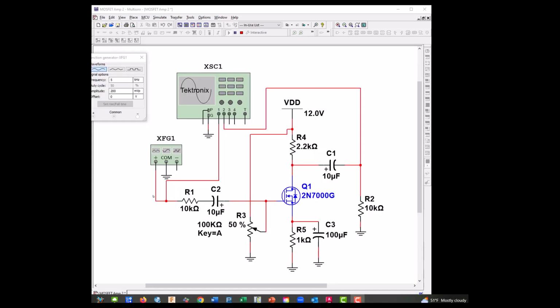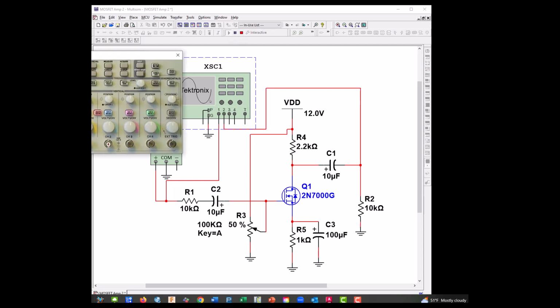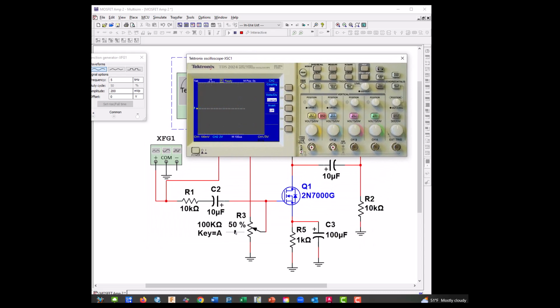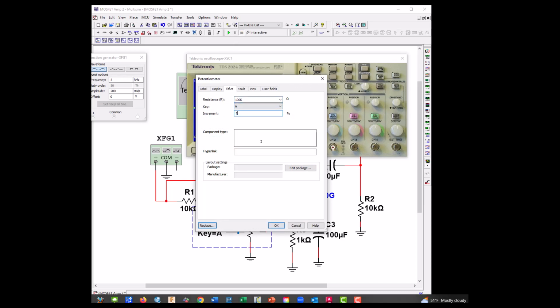Okay, I set this divider bias to midpoint, and let's go ahead and set this to 200 because it asked for 400. And let's turn it on and see what we get. All right, so let's go ahead and move our slider here until it, okay, that looks pretty good, but let's go ahead and make that 1% and see if we could really dial it in.